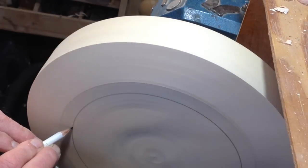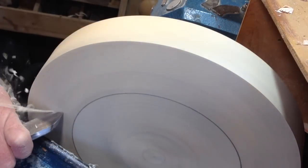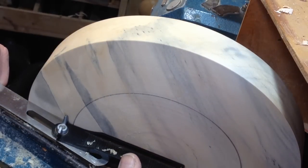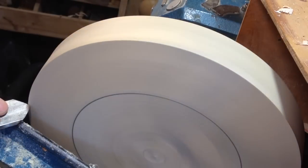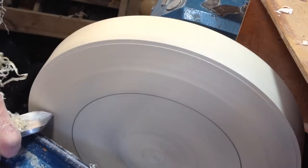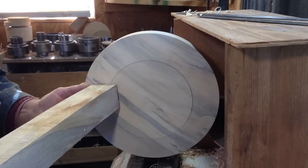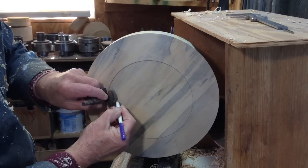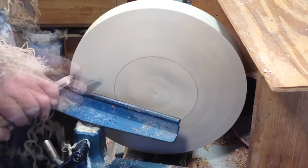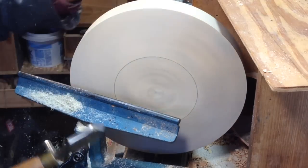A little bit more to come off, and I also realize I need a wider chamfer for the legs. I don't realize quite how wide yet. There was a bit of messing around here — this is a push cut to get it clean, but I found that the shear scraper did a much better job. When I check next time there's more to come off near the rim, so I set the depth to which I've got to cut, then take that away with the shear scraping. When that looks about right, I test-fit the leg just to see how it's going to look, and realize I'm going to get a better idea of where it's going to sit if I use the drill. So I've got to widen that chamfer yet again. Do that again with the wing of the tool, then the scraper. When I think that's flat, check that with a straight edge.